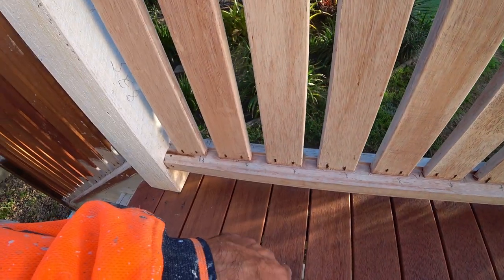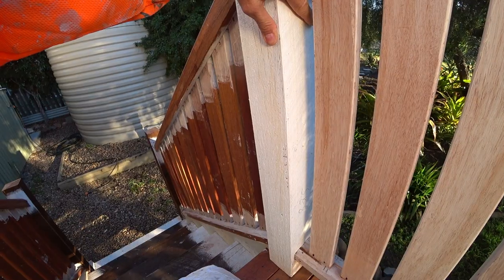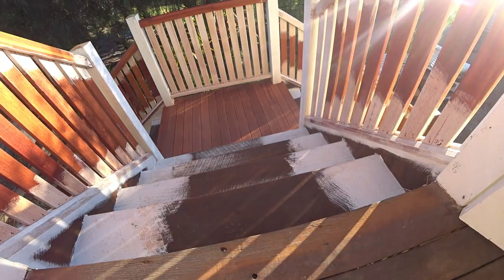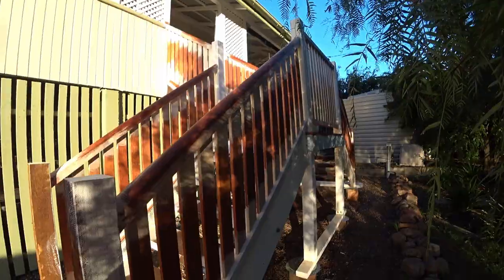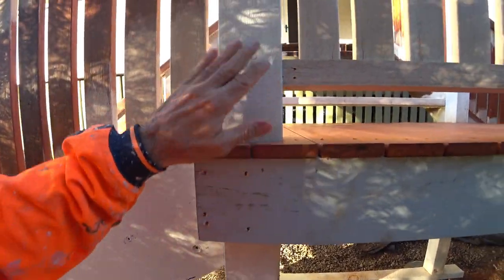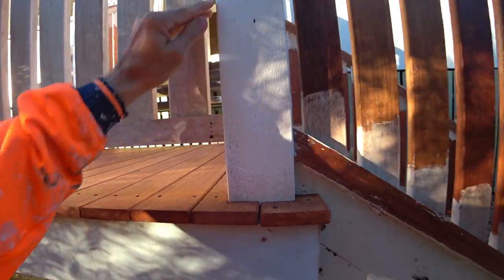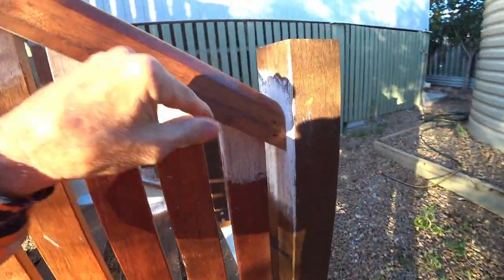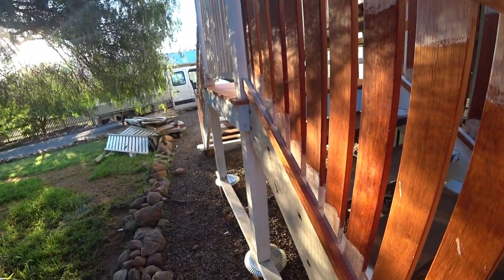All these will need to be puttied after we put a coat of paint on. We'll have to gap them, gap that section there. Most of this will be done by hand. Put a first coat on - we'll use a low sheen Weather Shield for our first coat, then we'll give that a sand. The steps are only going to be a green. I'm going to take one day preparing it and another day painting it. We'll put our first coat Weather Shield on in low sheen - that way we can see all the holes and gaps. Then we fill it and fix it, give it a sand with 180 or 120 sandpaper to get all the furriness off, then gap it all and cork it all.